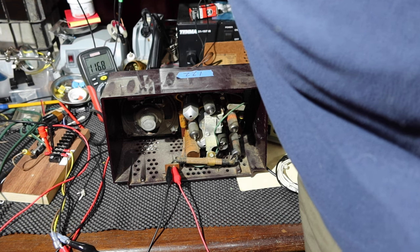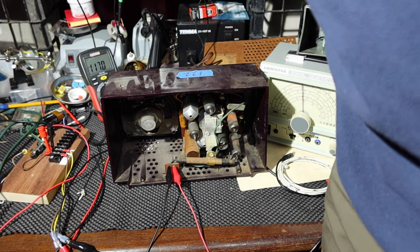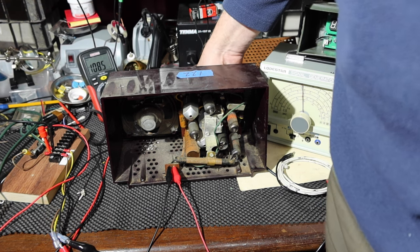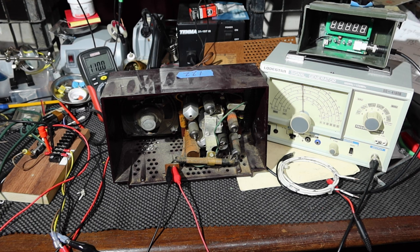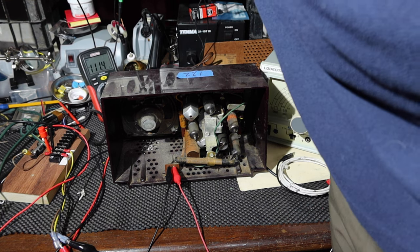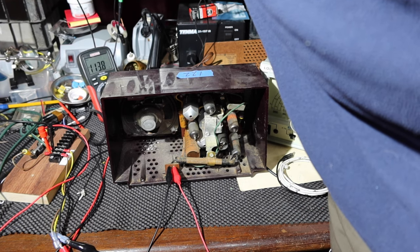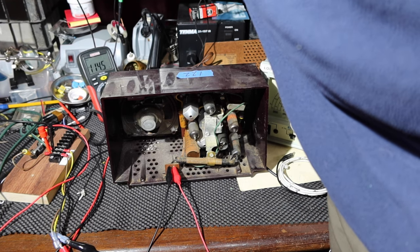And that'll be fine. Okay. I got this set for watts. And we'll turn the power on. Turn the voltage up a little bit since it's taking some current. What's happening is it's taking some current, it's going through the dim bulb, and that is drawing the voltage down a little bit.